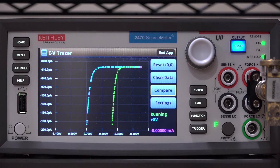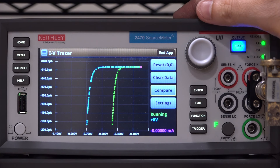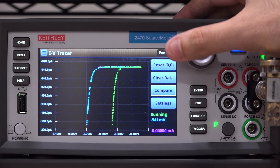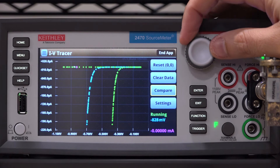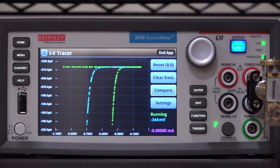Now let's try the last mixer — the one labeled as having a poor diode, 75 to 110 GHz. Increasing the voltage all the way to the limit shows absolutely no conduction at all — nothing at 400 mV, 500 mV, nothing. The diode is dead. But this also means we can take it apart without feeling guilty and see exactly how it is put together from a microwave standpoint. It's going to look really interesting on the inside.